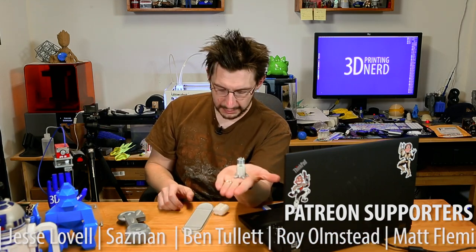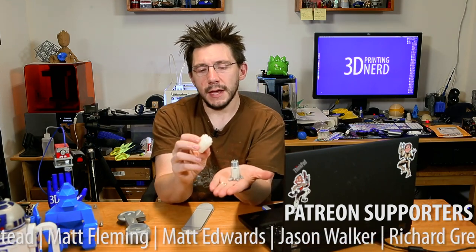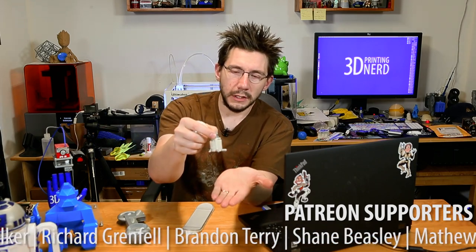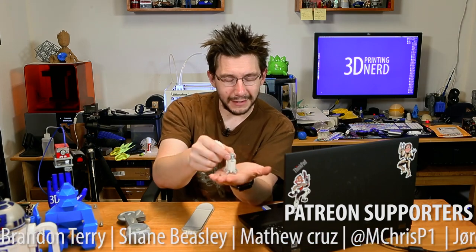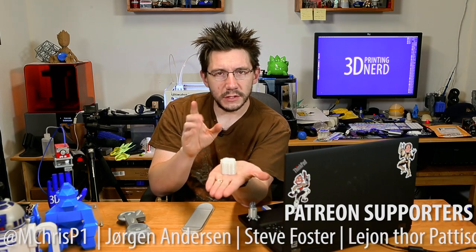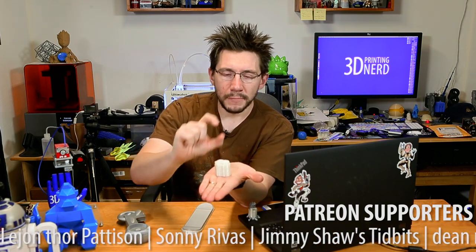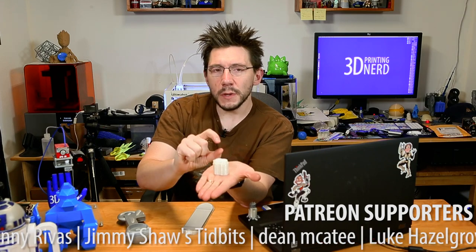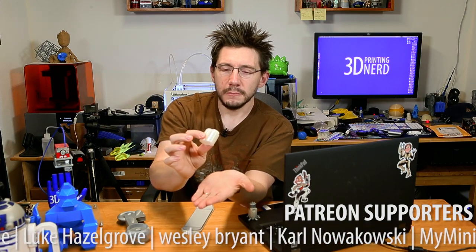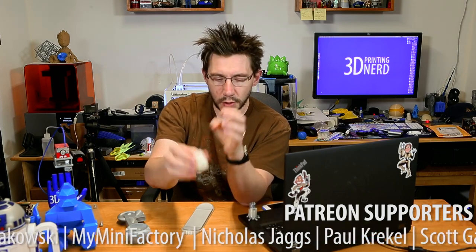Here's another model that I just printed — it builds it up just like this. This one's going to be interesting and I will dissolve it for the video I'm doing on the PVA supports. This is a low-poly group that someone in the 3D printing group I'm a part of made, and it's just awesome. And this is a little fidget toy that I had printed. In Cura I stacked six pieces on top of one another with a slight space in between each one, and in between each one was a PVA support layer. This giant stack of pieces should dissolve away and leave nothing but the pieces — the PVA should go away.